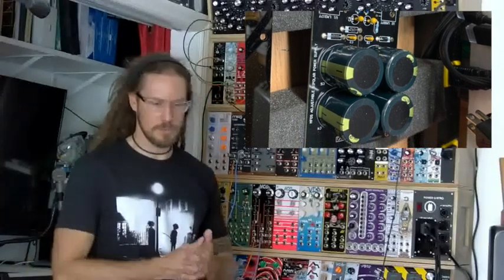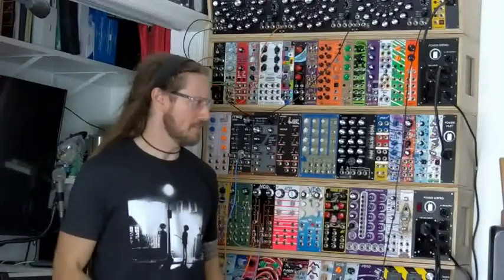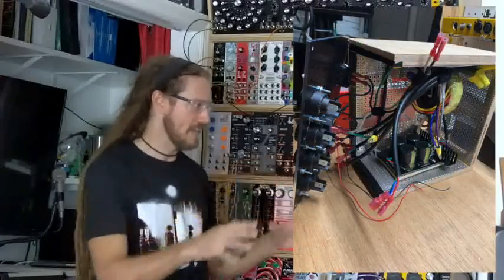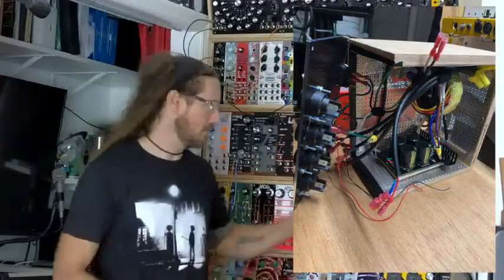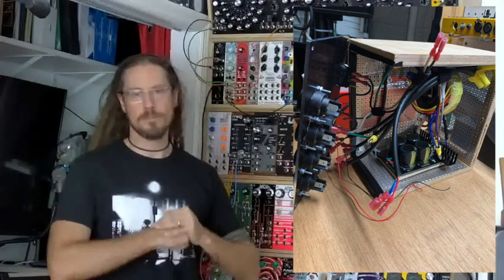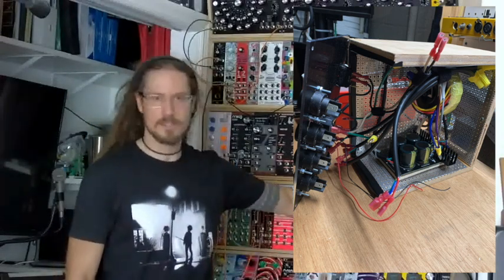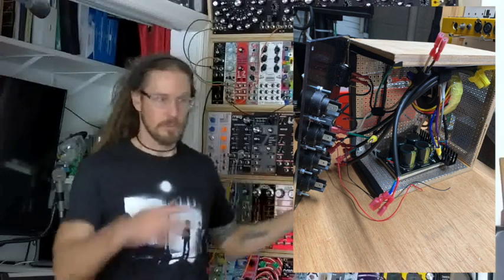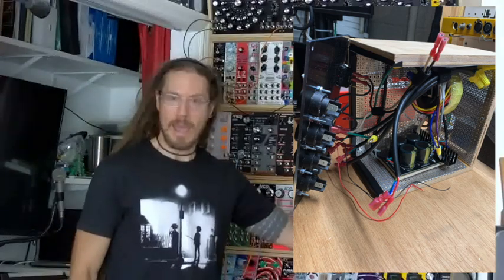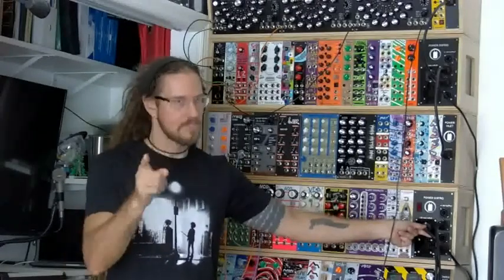In doing so, you learn how 3-rail power works. Specifically when you're building this, the one thing you notice inside of mine is that it has a cage built around it on the inside. It's great to vent, to make it look like a vent on the outside, but it's also there to provide my earth ground. If something did come disconnected inside of this power module and there was a loose wire flopping around, I want it to hit earth ground and go out the ground that my house uses, to prevent a ground fault.